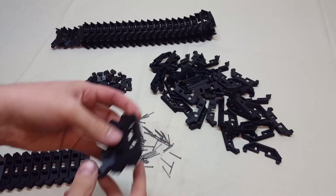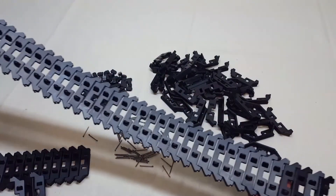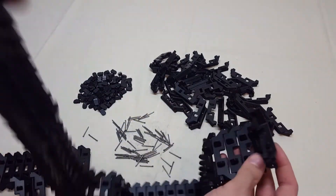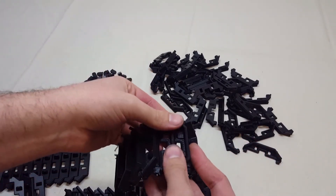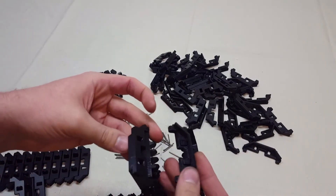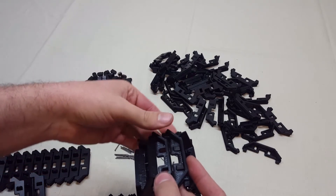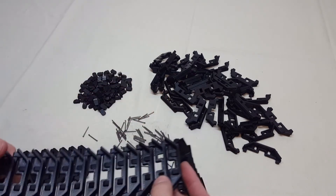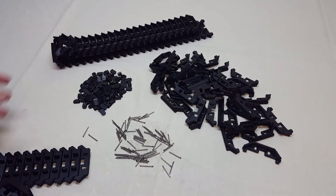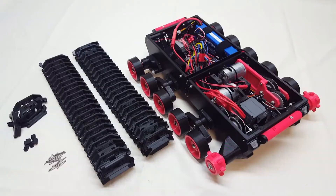Once you're done, it's about 47 links give or take one or two — that's what I was using for each side. Once the track is on the machine you'll want to put in the other two guide pins and push the nails in while on the machine. It takes me anywhere from one and a half to two hours to pin all the links — around a hundred total — but it goes by quickly once you get the hang of it.